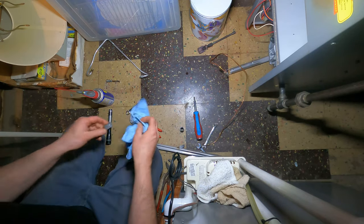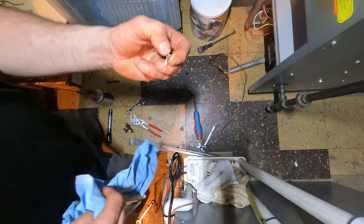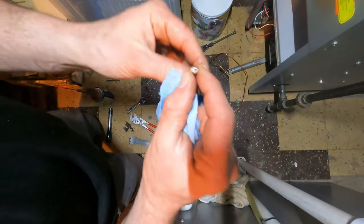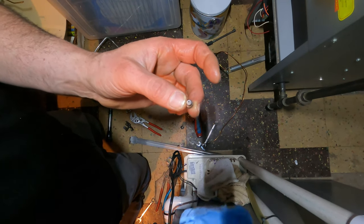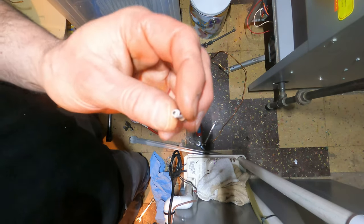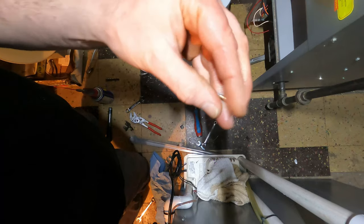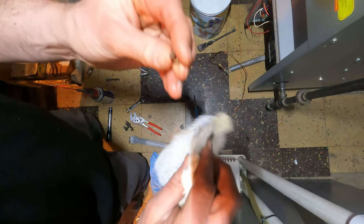You keep the pilot orifice nice and clean. Like, I toss that orifice onto the side. I mean, you could see all that white cake and powdery stuff. And this is what I'm trying to remove on my maintenances. So. Yep, there it is. Okay, so now you could usually just blow it off. Blow through it and it's clear because it doesn't even see half a pound of pressure. So that's nice and clean now, ready to go back in.